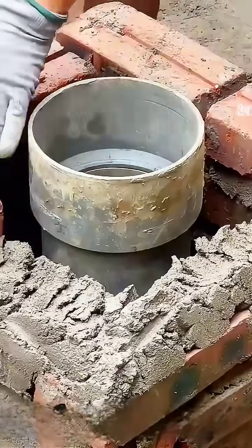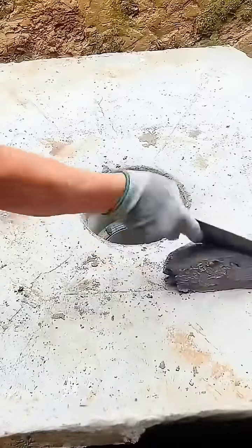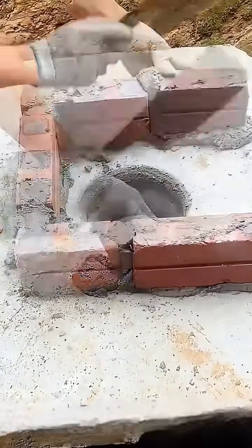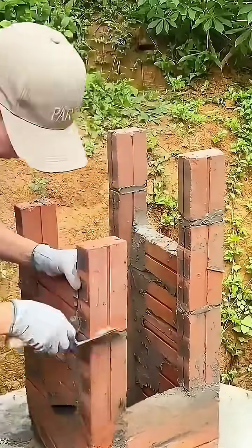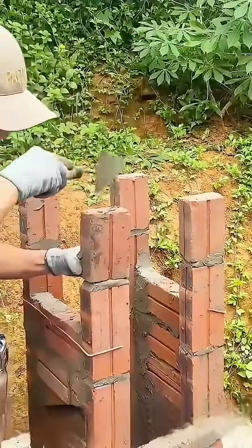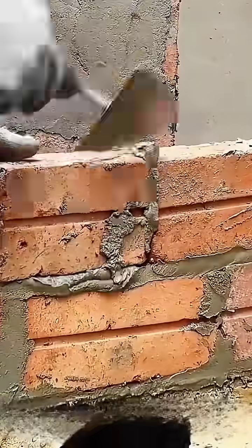When the height is approximately level with the pipe, a hexagonal cement template is placed on top, with an opening that aligns perfectly with the pipe. Below, a square frame is constructed along the center of the template, and the two sides of the frame are extended upwards, creating a unique groove in the middle. A layer of red bricks is then built along the edge, keeping the height at 50 centimeters.